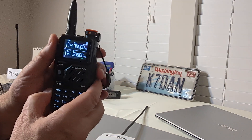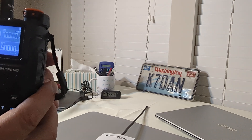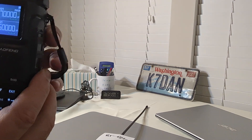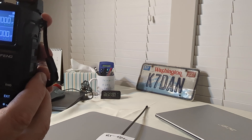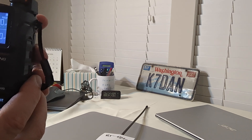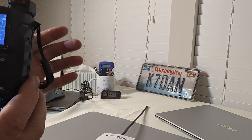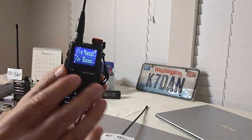Let's go ahead and listen to this Baofeng. This is Approach Control from Baltimore International Airport — I'm about 18 miles away. Let's listen to the audio. We're listening to 119.7, and 121.5 is the watch frequency. Could you hear that? It's almost all distortion. On medium-level and weak signals, distortion is much less. But on strong signals, especially if you're near an airport or at an air show, the audio is going to be very, very distorted. This is very common on inexpensive Chinese radios that include airband — they didn't implement the AGC.